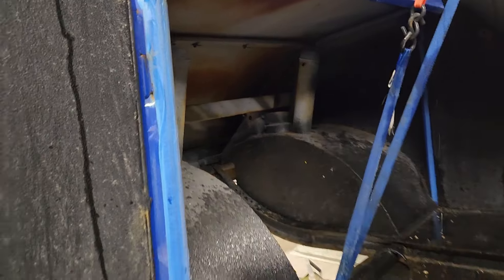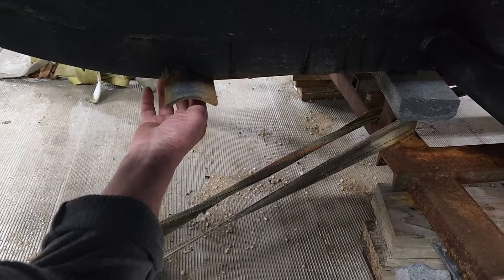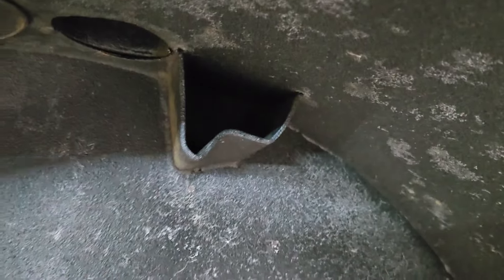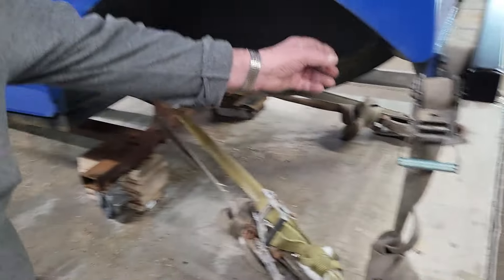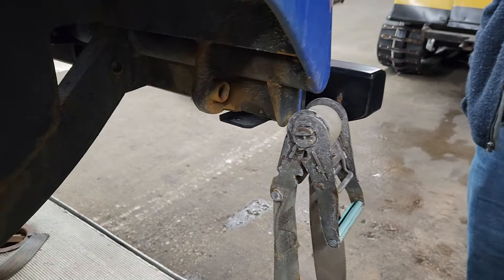Let's take a picture of those. And then another thing under here — you've got a chunk of metal about three-eighths of an inch thick, and you grind it so that you've got that little dip and you weld both sides. You'll never break these. That piece there has to be straightened. What I'll do is straighten that and put a chunk of channel iron in there — that'll never happen again. Find these things now before you start putting everything together. We don't use a hollow bolt in here; we put a solid bolt with a lock nut on it. You've got to respray this whole thing underneath — it has to be clean first.